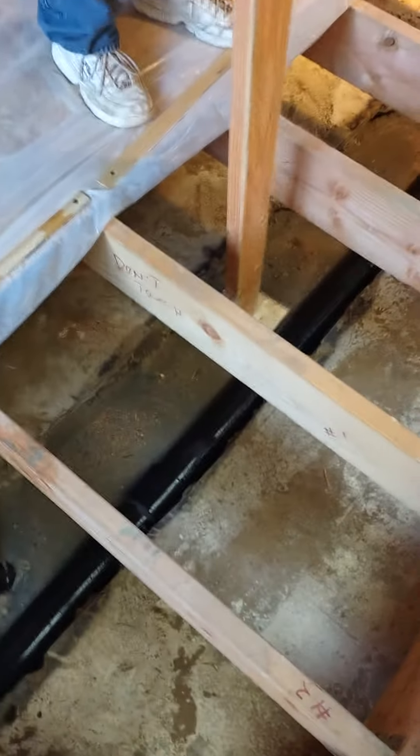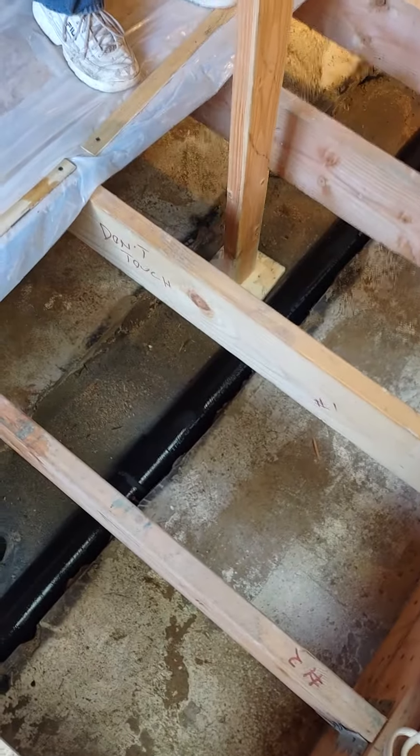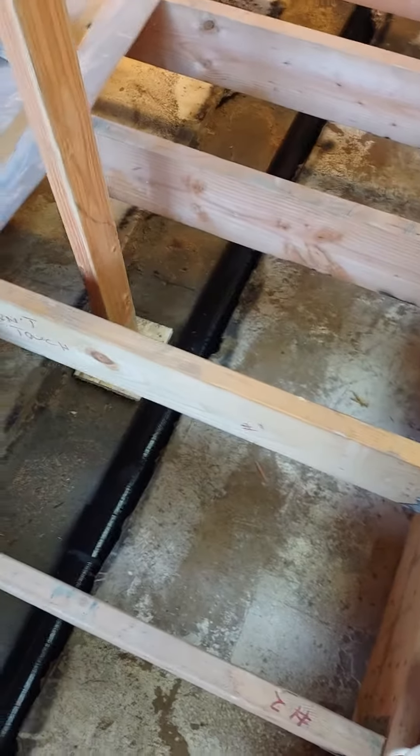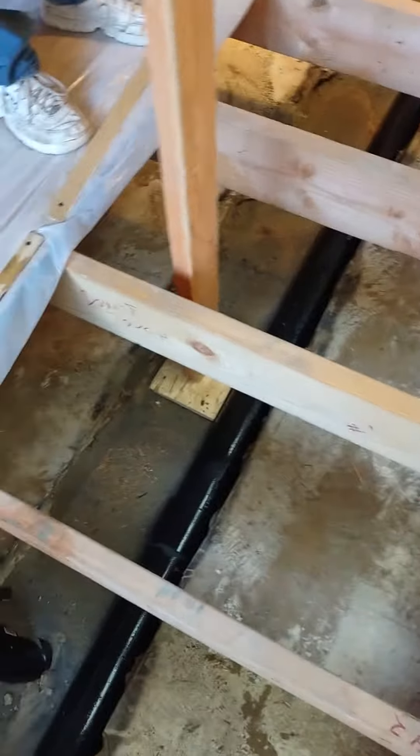This is your boy DC, the author of the Black Carpenter's Guide. The next step we're going to do is called tamping the soil. You got to make sure the soil is compact whenever you're pouring concrete. So you wet it down and then you compact it, especially because we're pouring over sand. So we got to make sure that soil is compact.